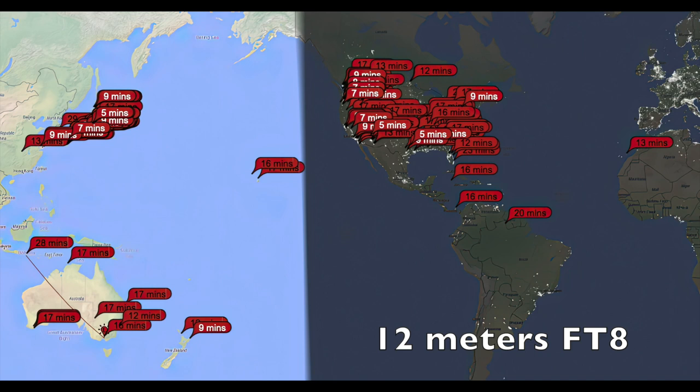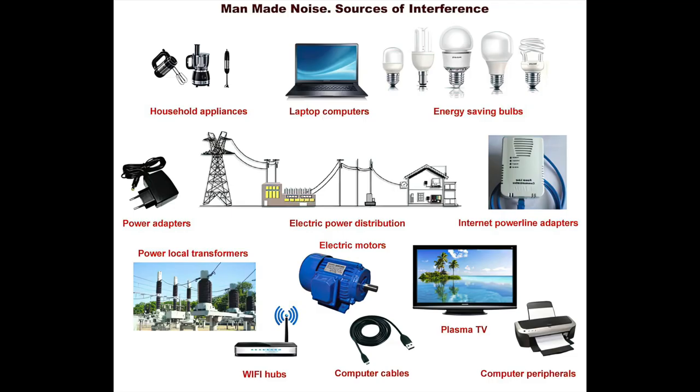Being a vertical antenna, its angle of radiation is low relative to the horizon, which is ideal for achieving the important DX factor — the distance factor — in your transmitted signal. One of the common complaints about verticals is that they pick up lots of noise; local man-made electrical noise tends to be vertically polarized and many vertical antennas habitually pick up this noise. But from a listening perspective I find the Gain Master to be a really quiet antenna. The noise pickup is very low, which allows weaker signals to come through — because this is a balanced center-fed design, it does not appear prone to local noise, at least at my locality.